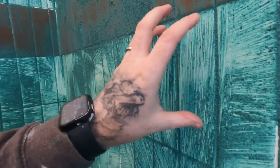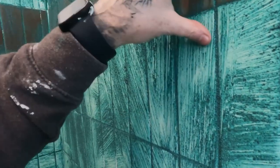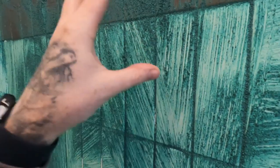So obviously the tiles are nice and shiny to start with, so you don't want to put anything on top of that because it's not going to bond to, or adhere to, the wall very well. So that's why we've done that. So when we dot and dab it, it's got nice adhesion to the blue grit. So then it's solid. Then what we've got to do once it's all sorted and level, upright, gone off, tomorrow we're going to come in and drill some mechanical fixings into the Wedi Board so it's solid absolutely everywhere, so there's no problems.